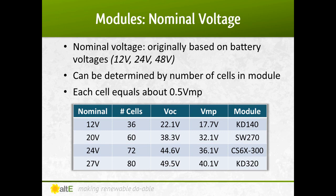In general, you can determine the nominal voltage of a module by the number of cells on the panel. A 12-volt nominal panel usually has 36 cells, and its open circuit voltage is about 22 volts, and its maximum power voltage is around 17 volts. So you can see how it can get confusing with nothing actually being 12 volts. However, as grid-tied systems that don't use batteries have become more popular, you start to see different size nominal panels that don't logically line up with battery bank sizes. The most popular size modules used in grid-tied systems today are 60-cell, 20-volt nominal modules.